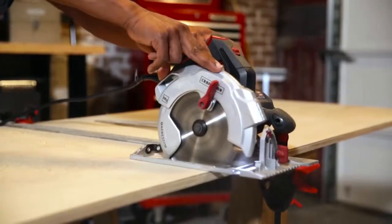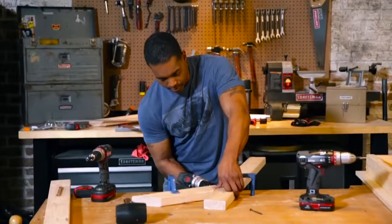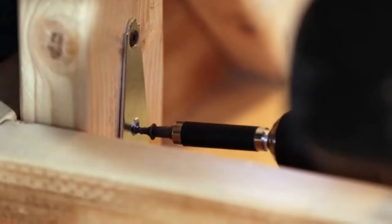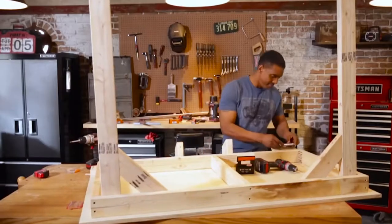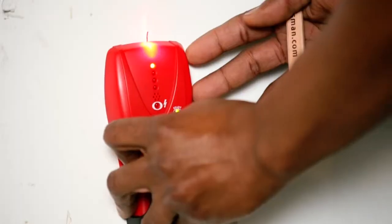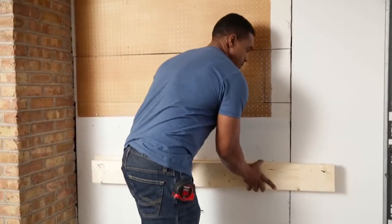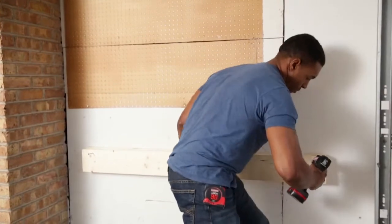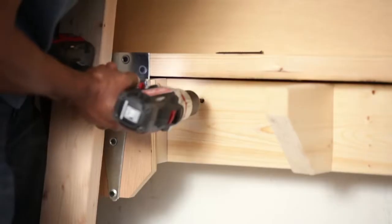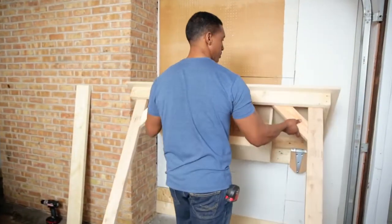The tabletop is cut from three-quarter-inch plywood that sits on a 2x4 frame. The legs are 2x4s with support braces attached with T hinges. The bench attaches to a bracket that screws into the wall. Find your studs and screw two 2x6s into the wall at the proper height. These will create enough clearance for the bench to fold up against the wall. Screw the bracket into the 2x6s. Now you've got a workbench when you want it and a space when you don't.